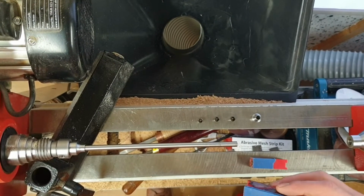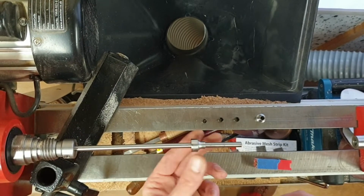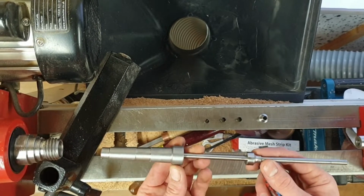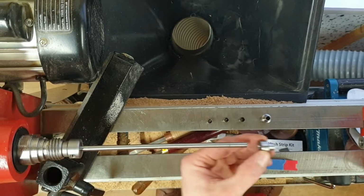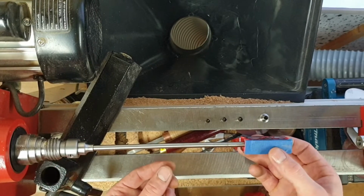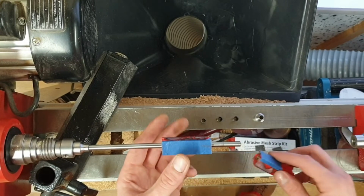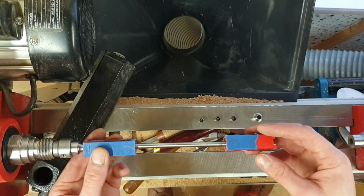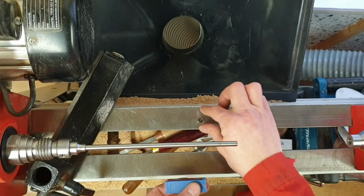Okay, we're over at the lathe. What I'm going to do now is show you the process of putting this onto the mandrel. This mandrel comes as a set, like that. Push one end in. That bushing. So then you put it that way, remembering that your orientation marks for your pattern that way, so you want them in the middle. Sorry, I'm telling you wrong, forgot the bushing.